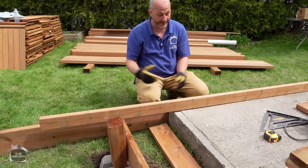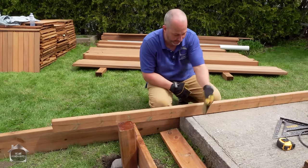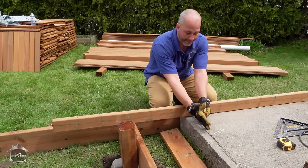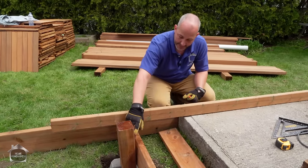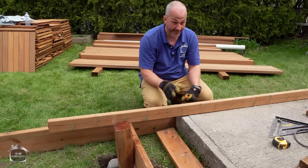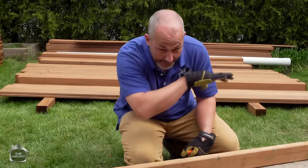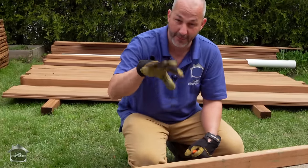Because these panels behind us actually finish, if we start on that edge, they finish right here. So we're going to have our deck extend over top to cover the gap. And so what we want to do is establish this height. Now it's the tricky part, right? We need mercy. The slab is all over the place. We've got a 3-inch variance.